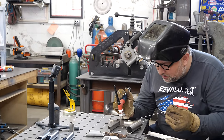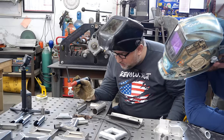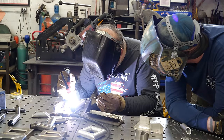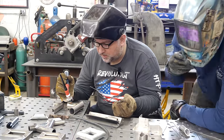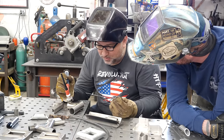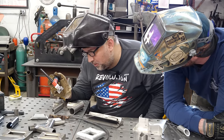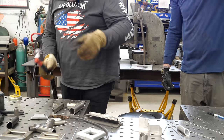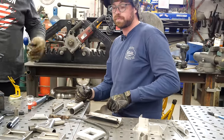So that's something that's not good in titanium. The weld itself is clean, but in stainless that wouldn't be good either — there's too much heat affected zone there. I don't know if it comes off with a passivation machine or not. I pulled that out too soon — now it's all brown and black. Keep the filler in the weld too. But I raised my hood with the left hand out of habit. The weld itself looks good. Just cause you see a little heat affected zone, I don't know if that's a deal breaker — on titanium, from what I've heard, supposedly yes.